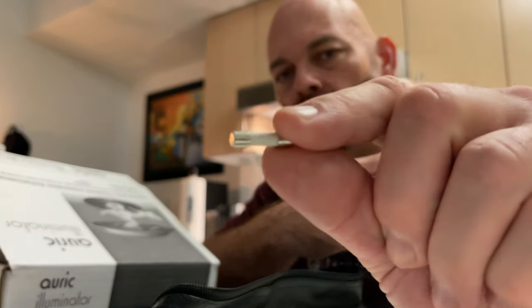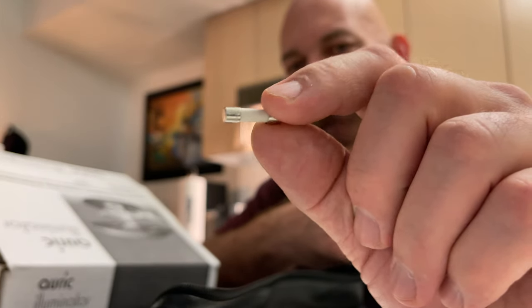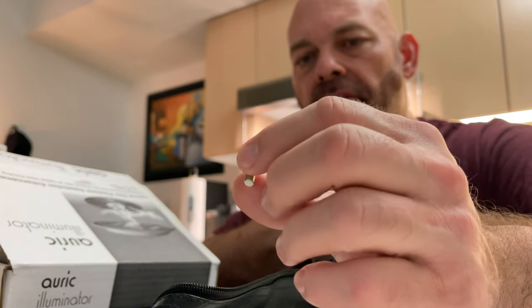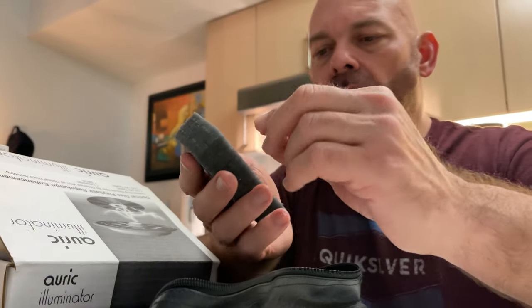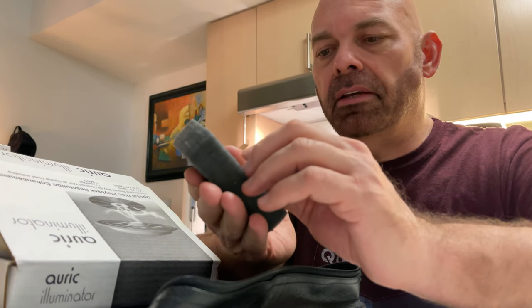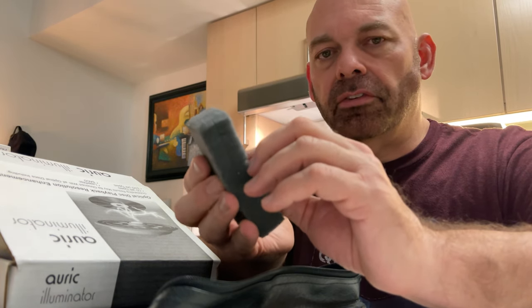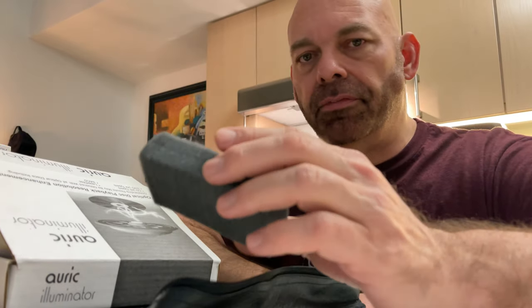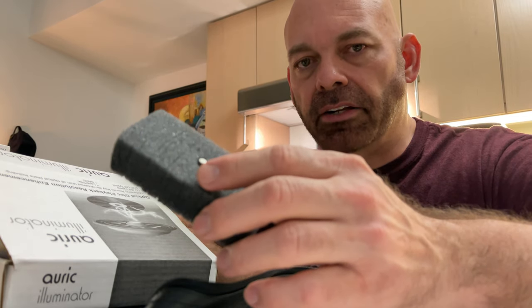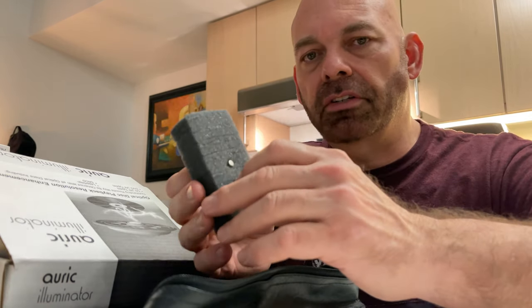It's the 5x20, one amp, I think 240 or 250 volt. I ordered the same size except I got it in a 1.25 amp fuse, because from what I understand the tolerance is a little bit tighter on higher-end audiophile fuses and they can blow. So I went just 0.25 bigger, but it is a slow blow - just like the factory one.